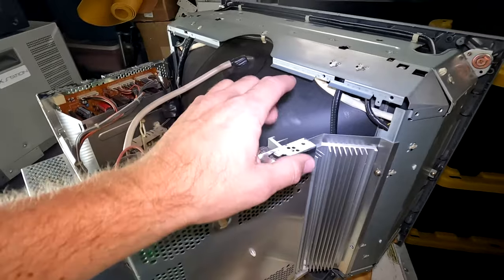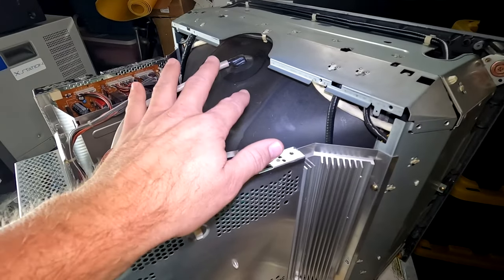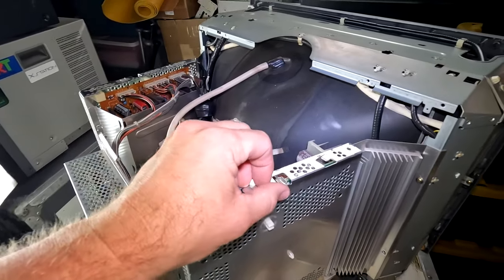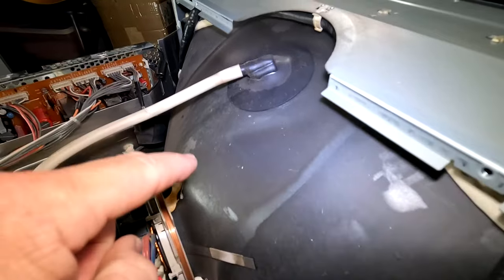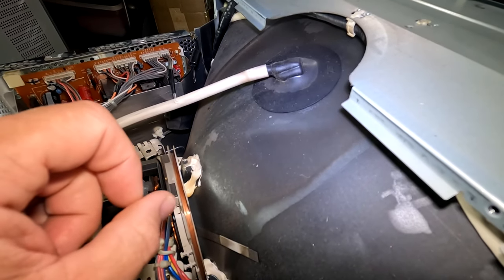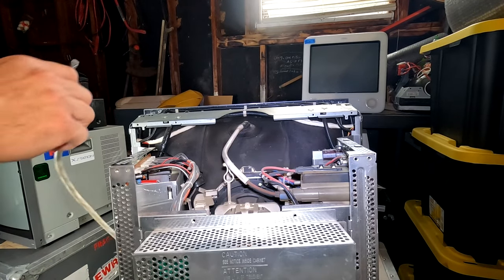We're still going to discharge the tube and the anode after we remove the cap, but we're going to try this a little bit different, to avoid scraping the backside of the tube really at all when we remove the anode cap. And we'll see, even though it does have that resistor, there's always a chance that we could still get a zap here. So we have to do this the right way. We'll see if there's still any kind of discharge here.